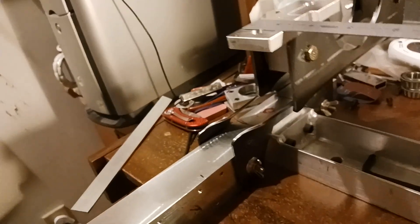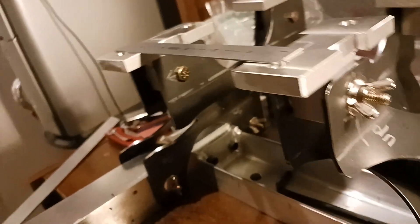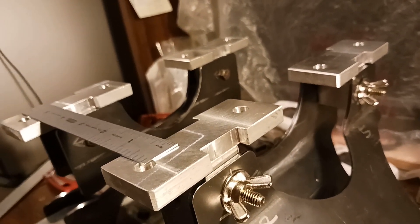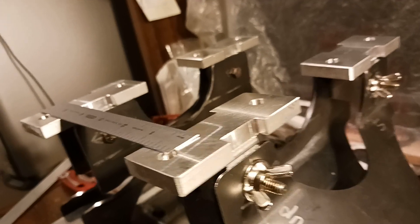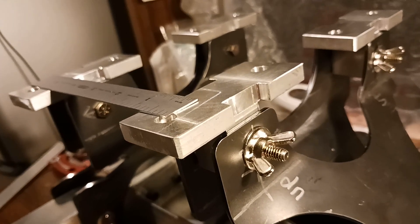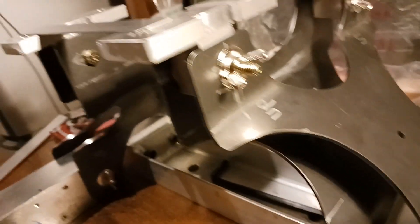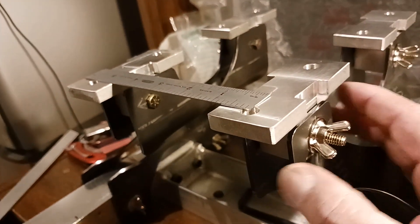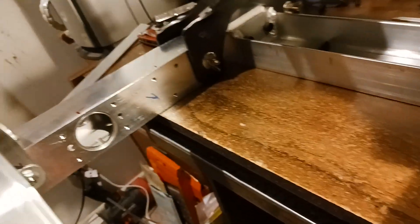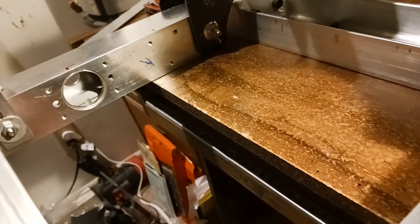It's a piece of one-inch square tubing that's been welded to this piece, and the little foot pieces are going to be mounted with the T-nuts into the ways of the table. This is the bottom — the part that mounts on the table — and this is going to be the top. I've got the little ball unit off right now because I'm attaching a disc brake to it.